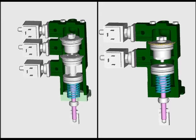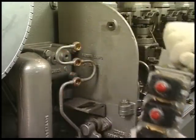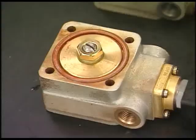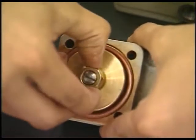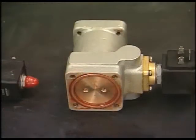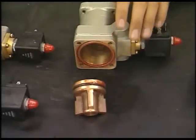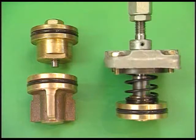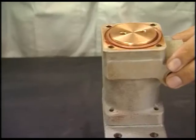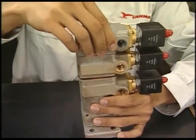I'll explain how to do it. Firstly, remove the air piston assembly from the engine. Secondly, remove the fuel limiting air piston and the piston for stop from the body in order. Renew the O-rings fitted in each piston's side surface. After greasing the pistons, reassemble them in inverse order of disassembly.